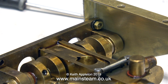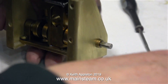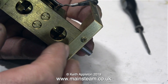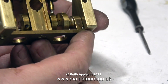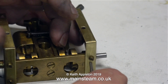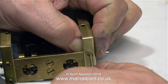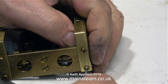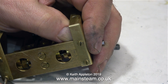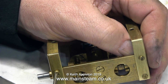That's one down, onto the rest of them. It's important not to tighten these parts up until you've got them all in position. If you tighten as you go, sometimes you can find that one or more of the bolts might not go into the holes properly — but not so in this case because these holes are well oversized for the diameter of the bolts. Now that everything's in place I can finally tighten them up. The good thing about using steel locking washers is that the sharp edges bite both into the piece of metal you're mounting to and the nut itself, so you don't need to use a spanner.